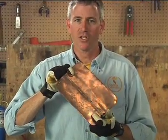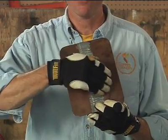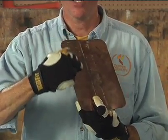Inspect the front and, when possible, the back side of the seam. On the front, there should be no gaps. Solder should fill the seam and characteristic stitching ridges should pass back and forth across the joint. On the back, solder has flowed all the way through the joint, appearing at the edge of the lap.